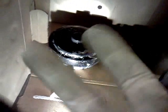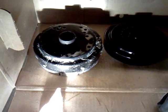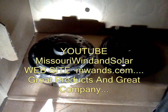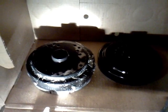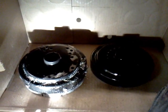I just did a quick spray on them. I held them in my other hand — wear gloves, it helps. That way you can just remove the gloves. This stuff is pretty strong, it smells like bananas — it's good stuff. Missouri Wind & Solar, their product is what you really need to use. Right now I'm just kind of slapping a ceiling fan generator together — I want to see what wattage I can get out of it. That's just to protect the metal. After, I'm going to go over it again with some more colored paint, but this way everything's protected. It's very shiny. Jeff does clear and he's got a green — I'm curious about the green, I might have to order some of that.